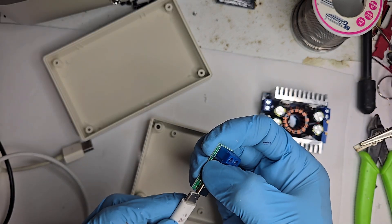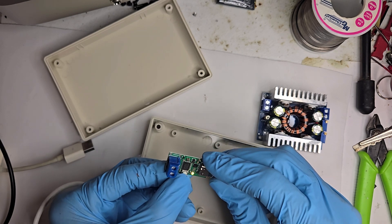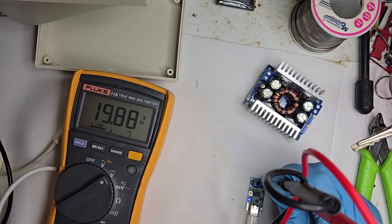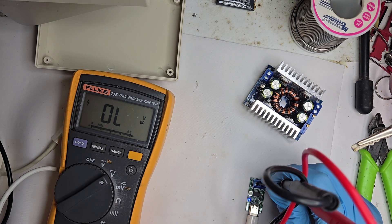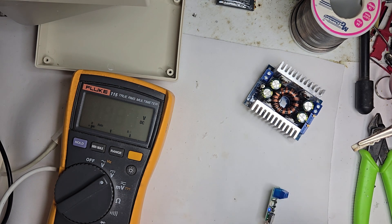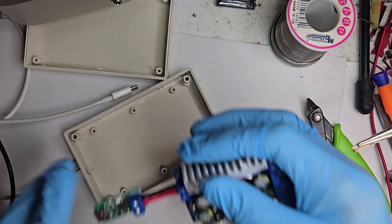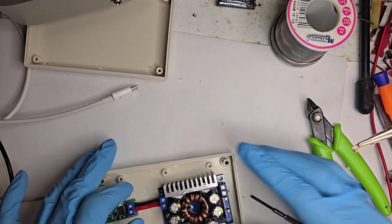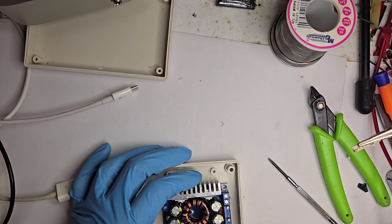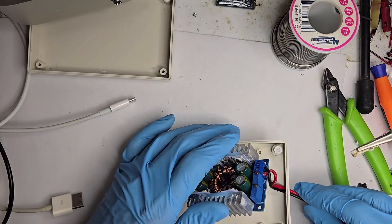This will be our second high-powered USB-C port. I'll be honest, not my favorite method, but we're out of options. To stick with proper USB-C protocol and still squeeze out real power, we've got to set the input board to 20 volts at 3 amps — that's 60 watts. Then we step it back down using a buck converter to 12 volts at 5 amps to make it usable while the M4 is under heavy load. It's a bit of a workaround, but hey, it works.